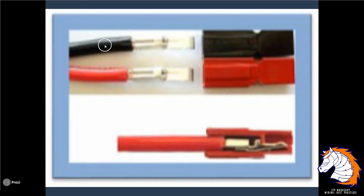This is the contact — the wire is stripped, you put the contact on, crimp it, then put it in the Anderson Power Pole. The orientation matters a lot. If you can see, there's a hook part on the contact and a metal plate inside. The hook attaches to and touches that metal plate, which allows the Anderson Power Pole to work properly.